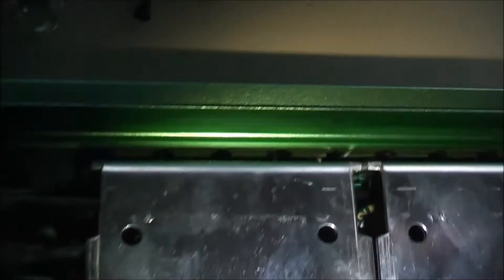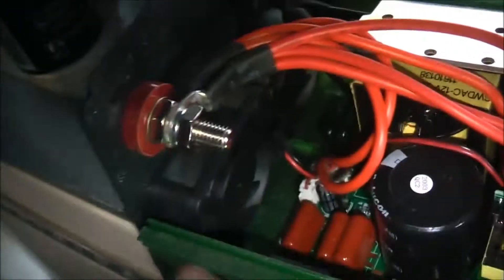Okay, well it looks promising. This looks promising. We have heat sinking inside and on the outside. Alright, I'll put this thing back together. I quite like it so far — that's what I want to see. The more of this you have when you open a pure sine wave inverter, the cleaner the output's going to be. And it's got extra cooling. No doubt these fans are probably going to need a drop of oil — my Mishto ones were noisy.